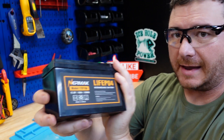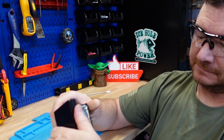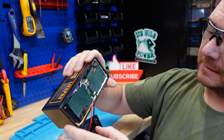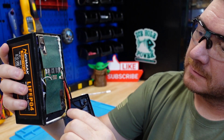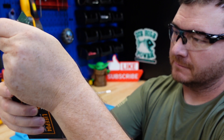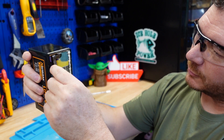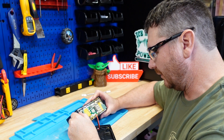10 amp hour toasted lithium iron phosphate battery. I thought these wires here would have burned up, but they did not. Look at that — these terminals here got pretty hot and burned through the fish paper. It was pulling at one point 150 amps. Yeah, she got pretty warm around there. Oddly enough, so far the build quality doesn't actually look too bad from what I can tell.